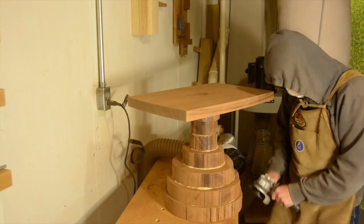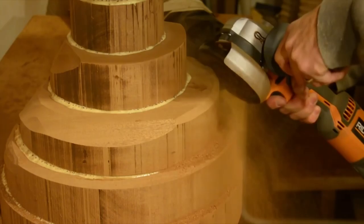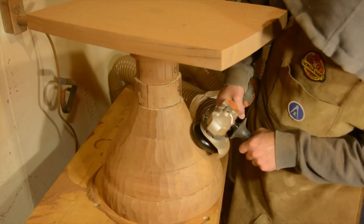After using this product for a while, I've realized that the best location for contacting the tool blade to the material is somewhere around the two and three o'clock position. It allows you to smoothly and easily control the tool while removing a good deal of material. In this shot I'm hogging away a good deal of material — taking a really aggressive cut, still making contact at the two to three o'clock position of the tool blade. This allows me to make almost a chamfer cut and continue to create a smooth arc all the way around the entire piece.